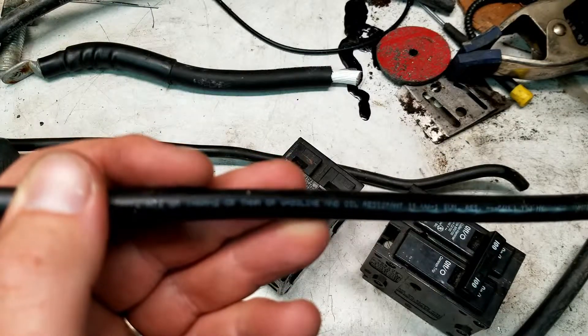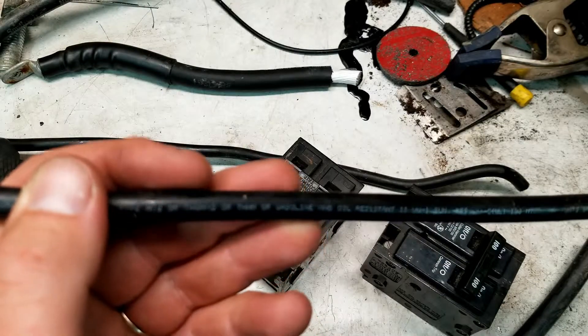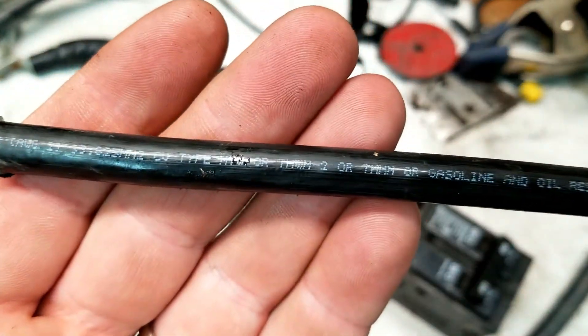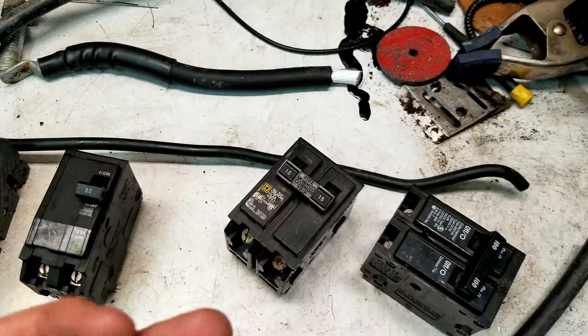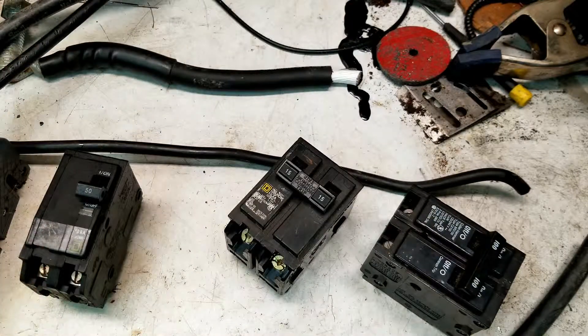Essentially, the safest option in most cases is just to follow the 60C column. If you have money to spare in your budget, just follow the 60C because that's going to be the safest and it's going to give you some cushion. And if you don't know your devices that well, it'll give you a little air gap for room.